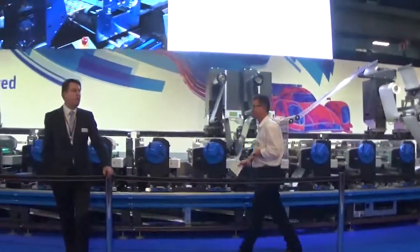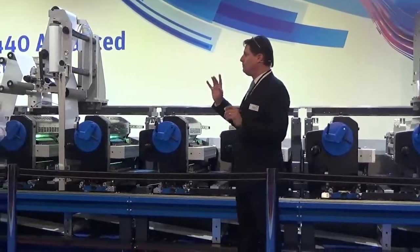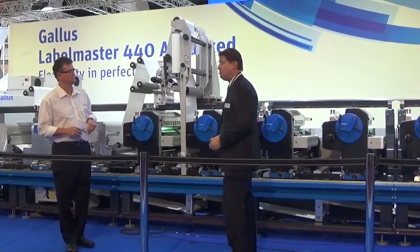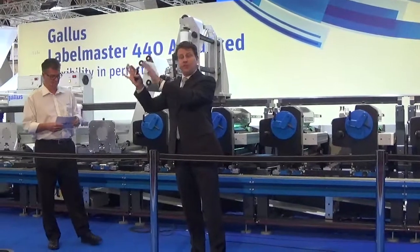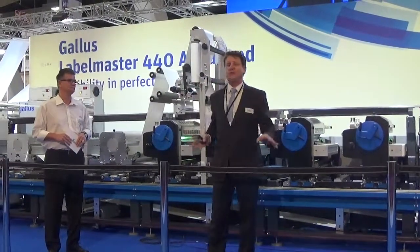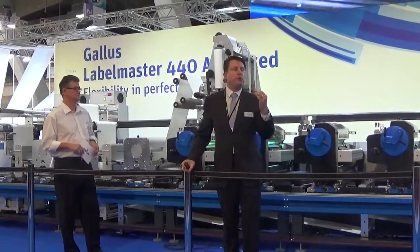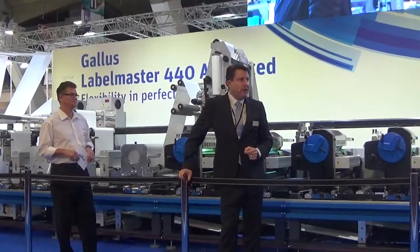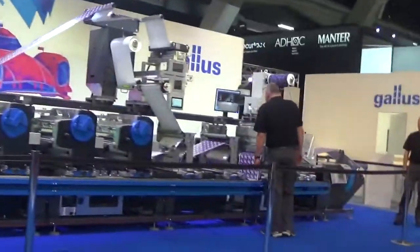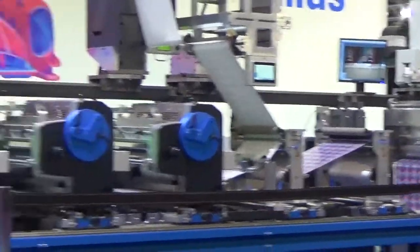A couple of things taking place — when we're done with the tours, please come up and take a closer look so you can see each of these processes for yourselves. You brought up a great feature and differentiator: the flexibility and automation on the system. We're going to see the eight-color classic press in a moment — that has fixed processes. But this advanced line is completely flexible, meaning we can change out any process in any position. It's a machine concept that allows every printer to buy only what they need. You get to choose either permanent processes in any position, total processing stage flexibility, or any combination in the middle.